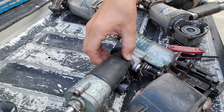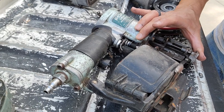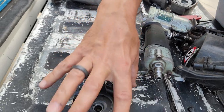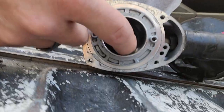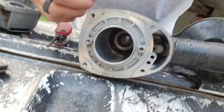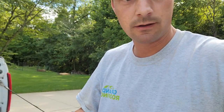In here is a little area of compressed air. There's the valve. When you pull this and the cone hits the decking, the roof, it will allow the air to quickly come up into this portion of the gun, and I'll show you that in a minute. It goes into this piston, which is removed, and due to the surface area of the piston being large versus the point of your nail being driven down by the plunger, that's the magic.